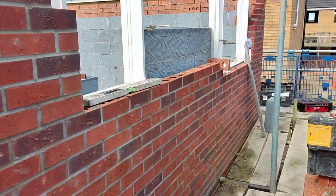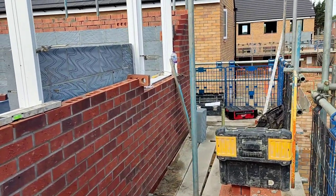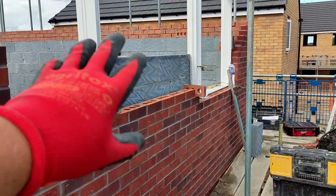Right, it's Tuesday now. We're on this other gable, back from where it's complete. Got all windows inset. So I'll show you what we're doing. That's all set. You can see there's about a 10 or 15 mil gap under that window. My block work are a little bit high, so I'm going to cut that. Trim that off of my cutter tomorrow, and then, because I'll leave this now,